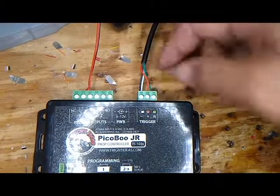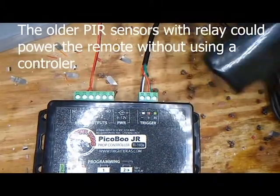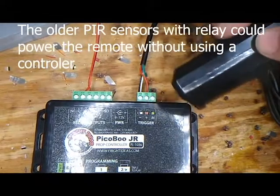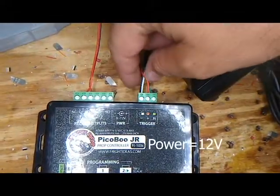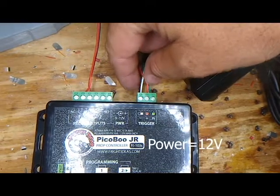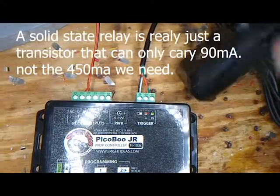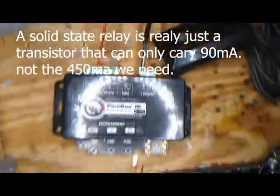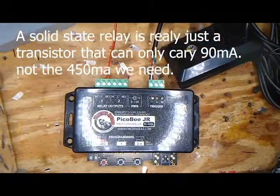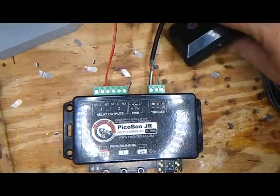That's basically how you hook up the motion sensor. I had some really old sensors that in the old days actually had a relay in them — all you had to do was provide power on the red and black wire and the white and green wire were relay. The new solid state ones don't have enough power to activate it, so that's not going to be the norm.